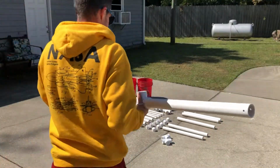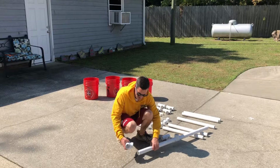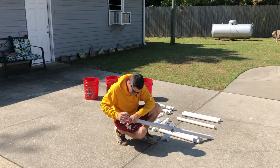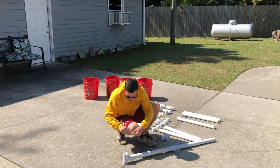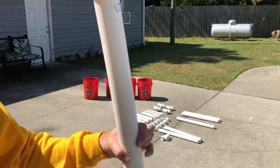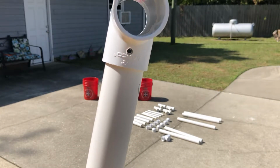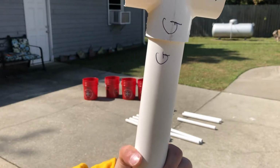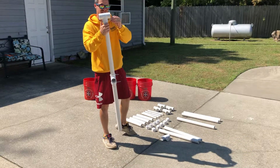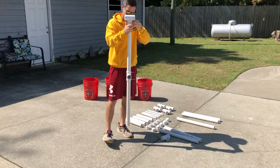So now we're gonna grab the side legs, and I'm gonna do that same concept with our other 90 degrees. Again, I have it pre-marked, so I can push this on, line up those holes. You're gonna take that bit on this same part with this 1/4 inch, and you're gonna drill a hole in here as well. You're gonna drill through. You're gonna do that same thing. You're gonna take the screw, and that screw is gonna slide through. Much easier than the other one. Boom.